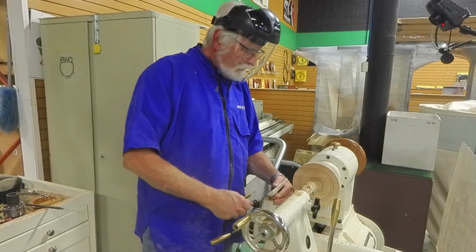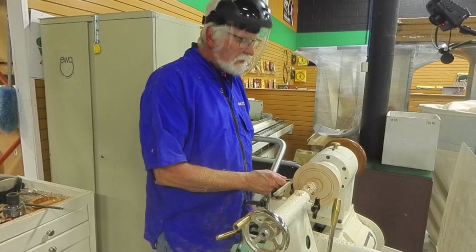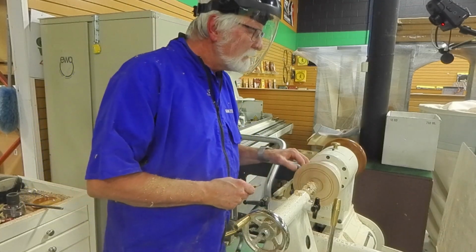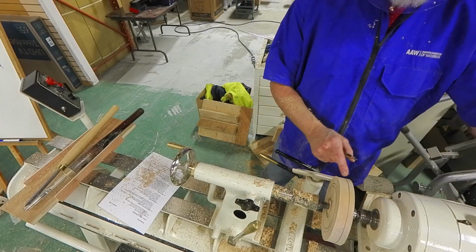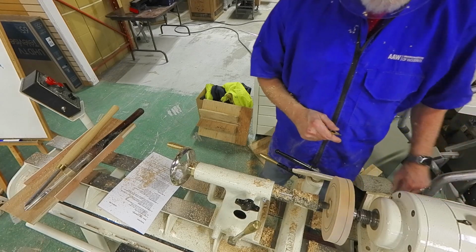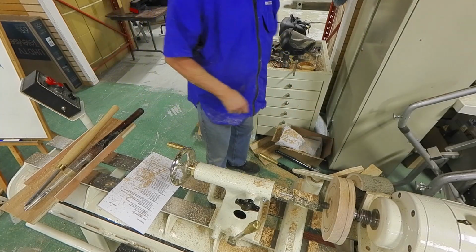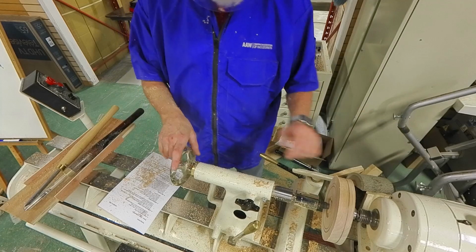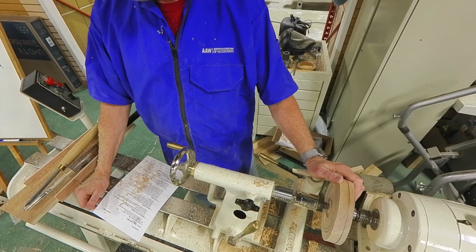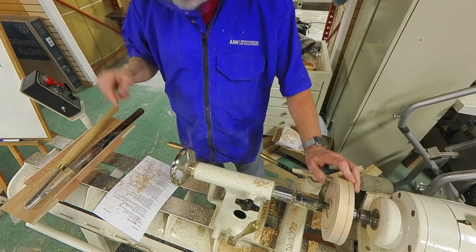And on the edge here, the same thing applies. So I like to, for these, I'll put it up, put a line on that's about maybe the top, John. Yeah, hard to see, but this is about a third of the way down from the top, two-thirds from the bottom. You decide, could be half-half. It's up to you. So now this is rounded up. It's secure in the lathe. I got some place to cut it. I like to get the bottom mostly done when it's like this. I can't finish the bottom because it's between centers, but I'll show you how you can do that.